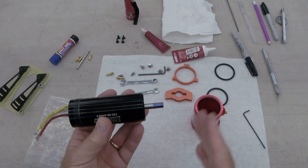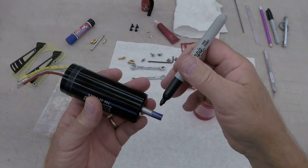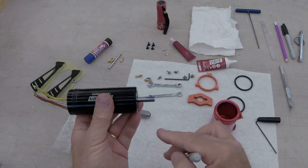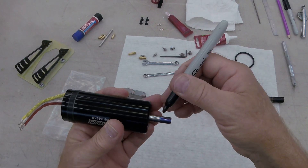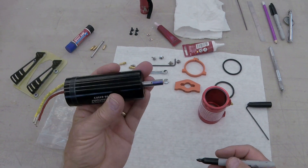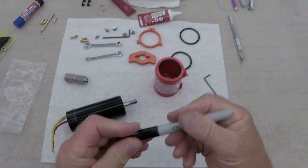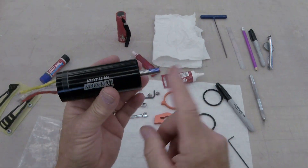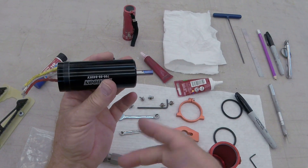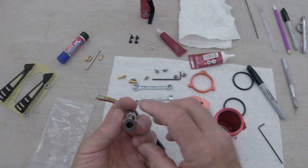So I know I need to cut a flat spot to there, but I don't need to go a whole bunch more. There's no sense cutting it off if I don't have to. Think about it this way: if I cut a whole bunch of material off of here, what am I doing to the shaft? I'm imbalancing the shaft. So I want to cut as little as I can get away with. I've seen guys on flat spots on prop shafts just take a ton of material away, somehow thinking that improves the hold of the set screws - it really doesn't.